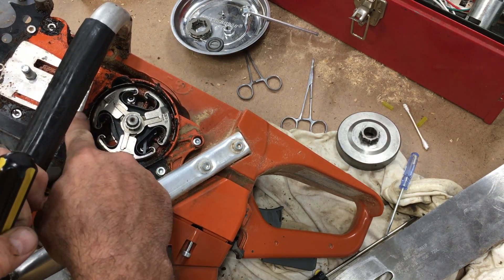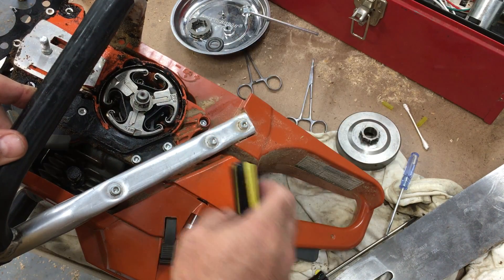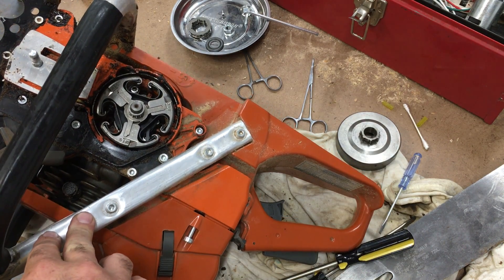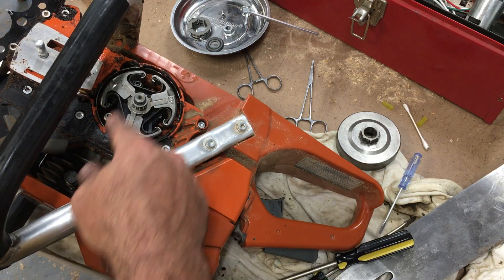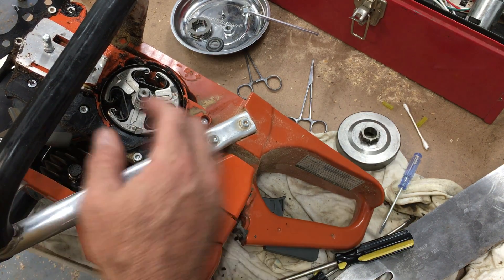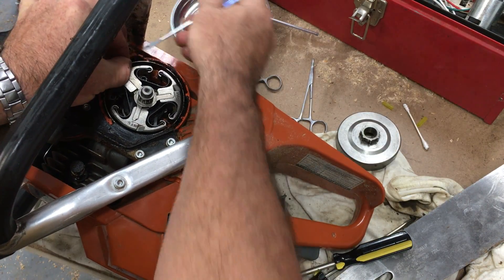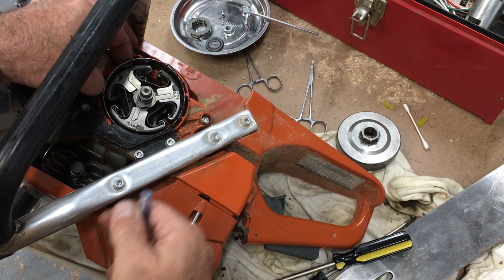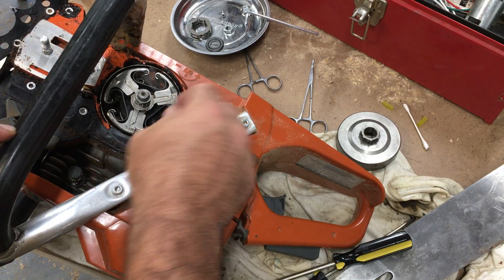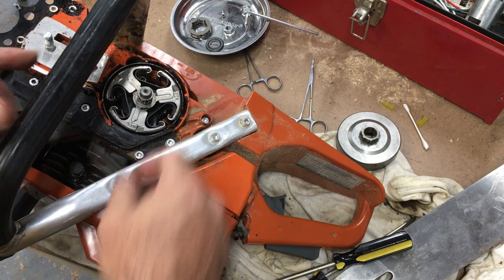The oiler has two screws. There's a brass tube that feeds oil to the bar that goes into the oiler. You do not have to disassemble the chain brake to get to the oiler — I've seen YouTube videos where folks are disassembling the chain brake to get to the oiler, and you do not have to do that. Just pop the chain brake forward; that gives a little gap and you can grab the spring. That little amount you can pull the spring up gives you plenty of room to pull the oiler out with the tube still attached, slide the new one in, and you're ready to go.